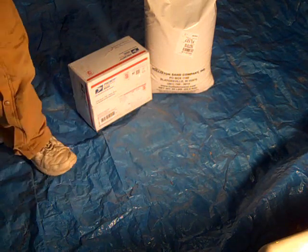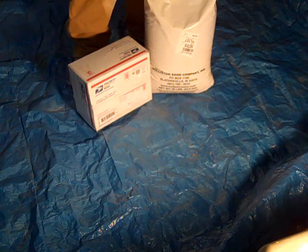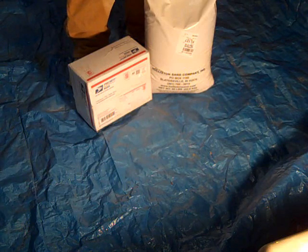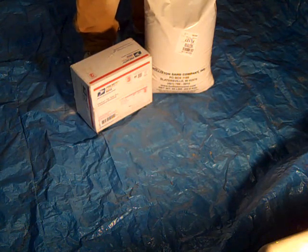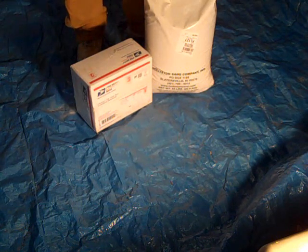This is silica sand — a 50-pound bag from the auto parts store, intended for sandblasting. It's double-zero size and supposedly pretty fine. This box is bentonite powder bought from lostandfoundry.com, supposed to be 12 pounds but weighed in at 13.5, so we're good. The recipe from their website calls for 100 pounds of silica sand, 12 pounds of bentonite, and a gallon of water.